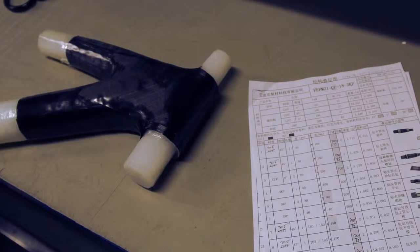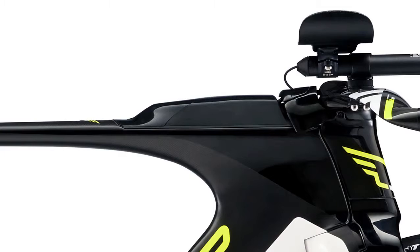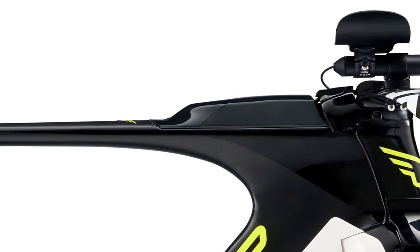There's generally more pieces, more individual patches and patterns for each carbon fiber layup, and it's a more specific or controlled environment for manufacturing. The UHC Ultimate, that's a recipe that almost changes year to year or as advancements are uncovered. Most recently, we're using the Textream carbon fibers in our UHC Ultimate blends. And UHC Ultimate goes right alongside our FRD approach of creating the very best. So those things are kind of all constantly in flux as we learn more and more about different materials that become available, and we learn how to best optimize and use them in bicycle frame manufacturing.